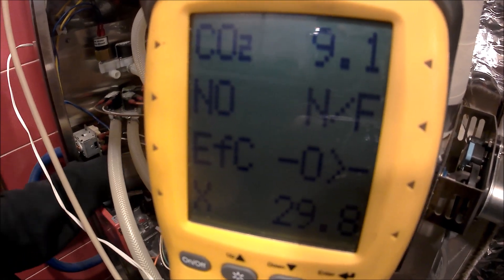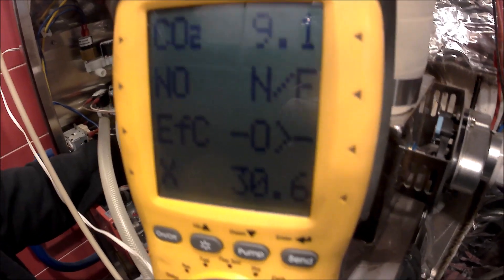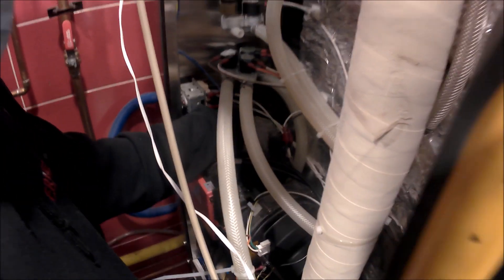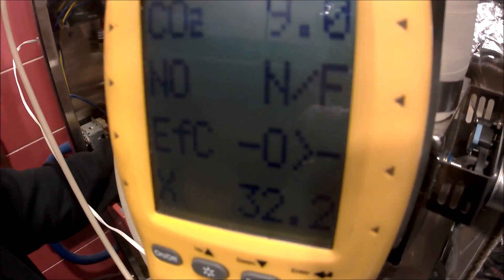On the gas valve there's a venturi. Turning it clockwise lowers the CO2 percentage, so we'll make adjustments little by little. We're down to 9.1% — I want to get to 8.8%. We'll continue turning by quarter turns; we've done almost one and a half full rotations. It takes time to tweak it to perform how we want. Now we're down to 9.0 and approaching 8.9% — almost at 8.8%, just need to be patient and trust the process.